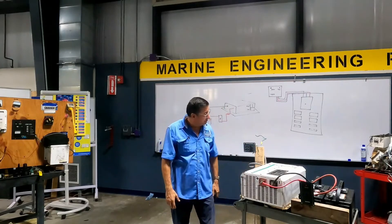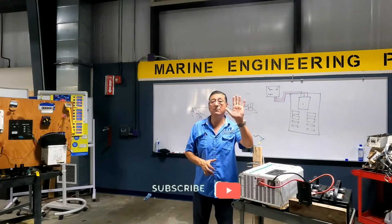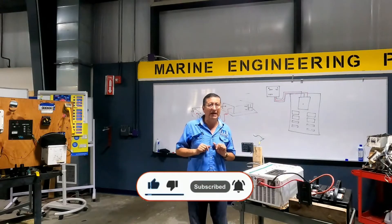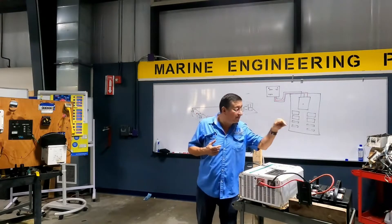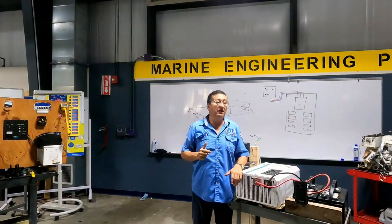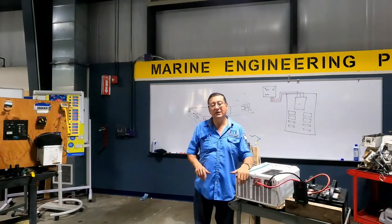Why? Because how many watts do you want in the output of this inverter? If you need six kilowatts, I calculate how many batteries you need — the amount of batteries and amps in the battery bank. That equation is expensive, especially because today people want to use lithium phosphate batteries and their price is very high. If you need 10 or 12 lithium batteries, that's a lot of money. So people start to reduce their requirements.